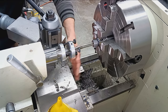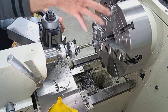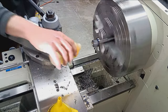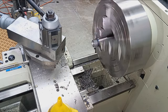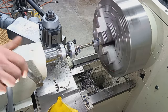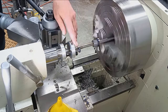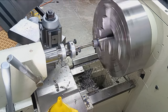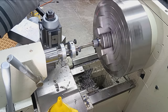So I've got my carriage as a stop, and we're not engaged in anything other than the pilot and the bore right now. So we'll lube everything up, kick it on, and take a pass. First pass with the chambering reamer. All right, so we'll feed in. Walk our tailstock. Slowly feed in, and I'm going to feel the holder and the reamer, check for chatter, once we engage, there it is, super slow,